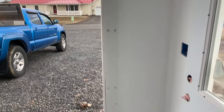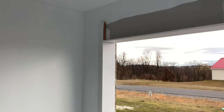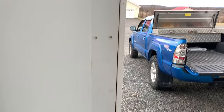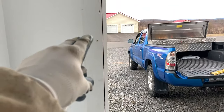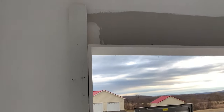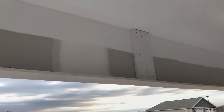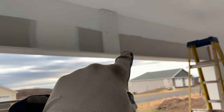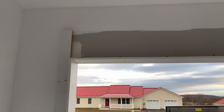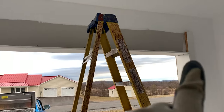Now we got to get these edges done — I have those pre-painted. Got the side on, and this side is done as well. You don't have to nail the heck out of it; just every foot and a half or so, put a couple nails. Most of the pressure on these is downward, so it's not going to pull off the wall. I'll put a couple more in, and these middle ones are really just for looks to make it trimmed out.